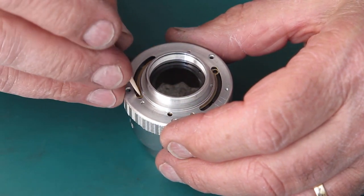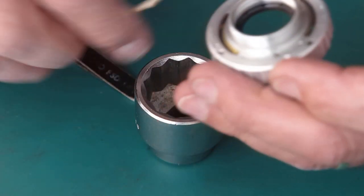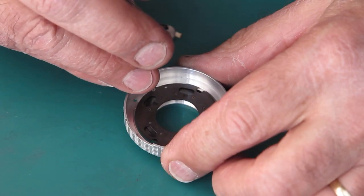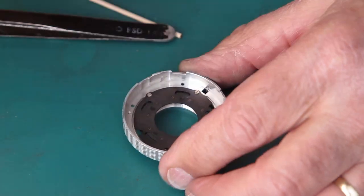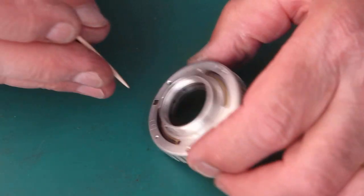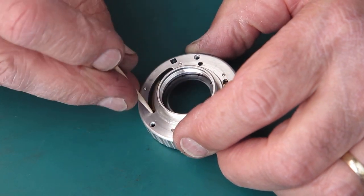Let's try it — the blades open and close. That's good. I've got everything in place; nothing was displaced. That's a good result. But as I say, it's more difficult to deal with blades with those cutouts — you have too many edges to catch on each other when you're trying to manipulate those blades into place.